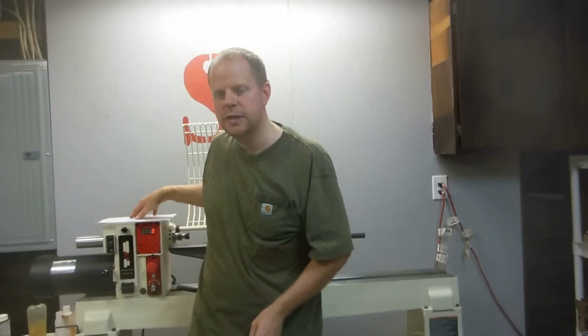And for the final cut inside, we used the little round cupped carbide tool to give it a good finish. And we also did some shear scraping on the outside with the Osprey tool held on its side to get that scraping action just like you would with a bowl gouge. So pretty much all the basic cuts that we do as woodturners we did here with carbide tools. It takes some practice. It's a different technique. You've got to get used to the tools, but you can do it.